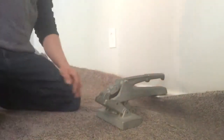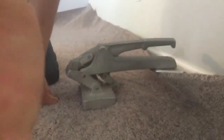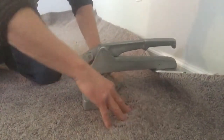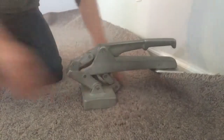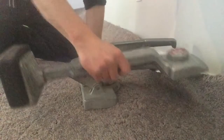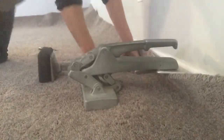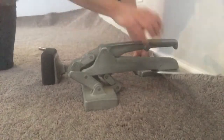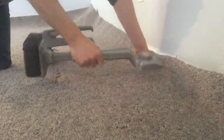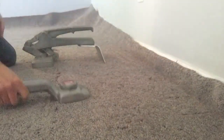I like to throw my knee into it so it doesn't rake the carpet. That's going to pull everything loose from this end of the room all the way down here. Look at that — you got that nice poofy poof going on right there. Hold all the slack down.